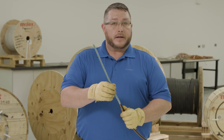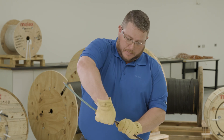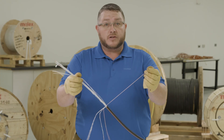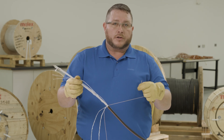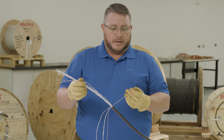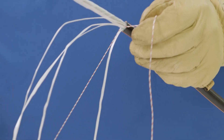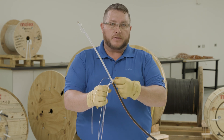Let's take this shield off and see what's inside. I can nick this shield and peel it with my hands to expose the cable. As we pull the shield off, the first thing you'll notice is the rip cords. In a lot of cables, a very fine cord is used to cut through the jacket, but the problem is it truly hurts technicians' hands, and they often have to wrap it around a tool. So we made our rip cords bright red and white so they're easily identifiable versus a water blocking agent. We also have two of them — whether you're doing a banana-style opening or you accidentally cut one off, you have an alternate way into the cable.